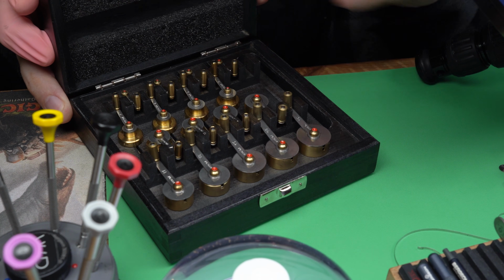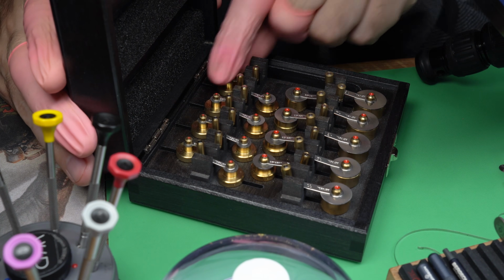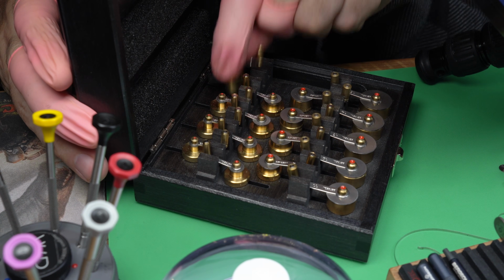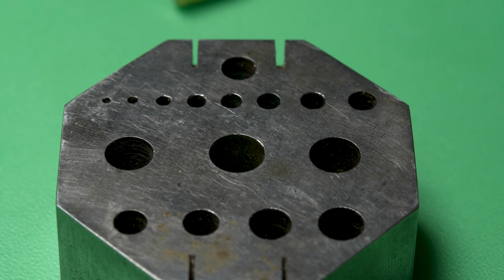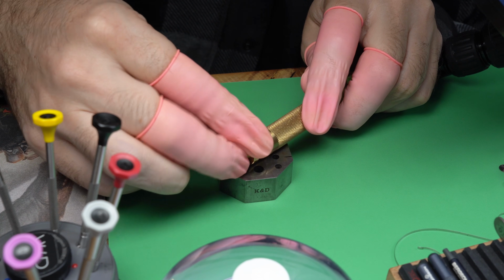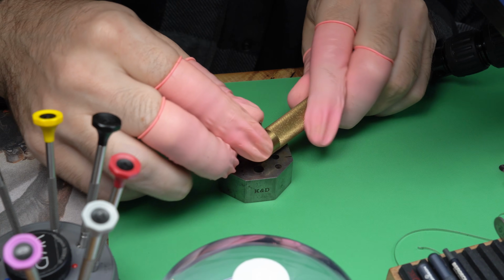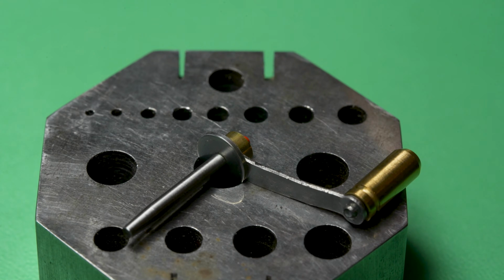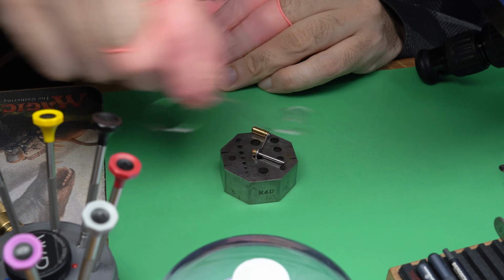So that means we can start with our reassembly, and this starts, of course, with the mainspring, and I get to use probably my favorite tool of all of them, which is like saying a lot because there's a lot of tools in this hobby. These are mainspring winders. And these allow you to safely put the mainspring, wind it up, and put it back into the mainspring barrel.